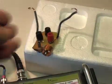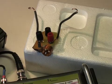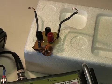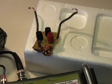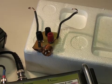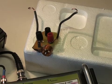The theory behind that is that the 100 ohm resistor on its own will null at 100 ohms on the resistance dial and zero reactance. When a parallel tuned circuit is placed across that resistor, the parallel tuned circuit will effectively short the resistor out at all frequencies except its resonant frequency. So if you tune the receiver around, you will hear a null at the resonant frequency of the trap.